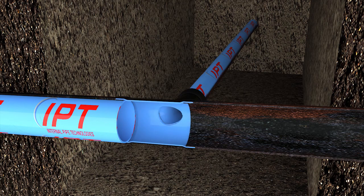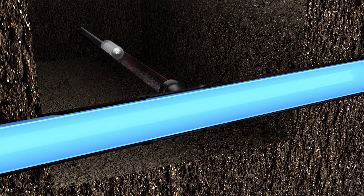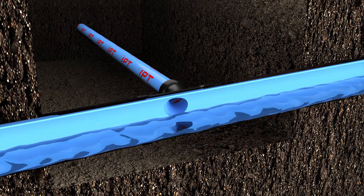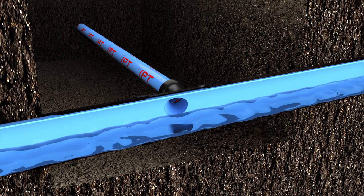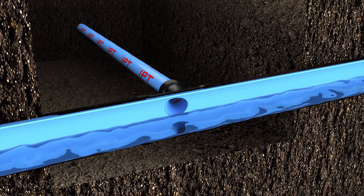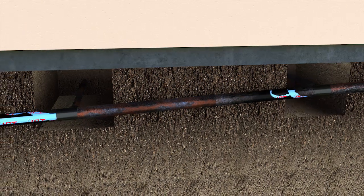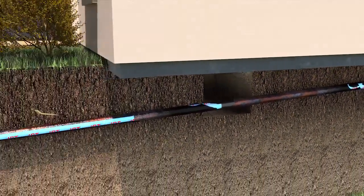Even the pipe connections can be lined. Branch lines from the roof vent, sinks, or other sources that have been lined over can be reopened using a special flex shaft cutter tool. The newly lined pipe keeps future corrosion from impeding the flow, renewing the life of the pipe. This process can repair any sized pipe, from small 1.5-inch laundry lines to large horizontal main lines.